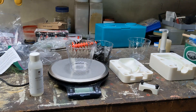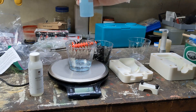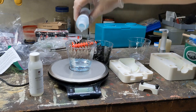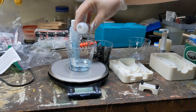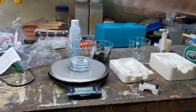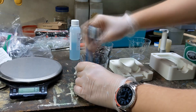Once I've got the carbon weighed out, I can move on to the resin. The one quirk I found with this kit — linked in the description — is that it was labeled as a two-to-one ratio epoxy resin, but it didn't say whether that ratio was by weight or by volume. Some epoxy resins I've used do specify that and often have different ratios depending on whether you're going by weight or volume. Luckily, it is labeled on the containers what the weight of each container is, so I could figure it out from the labeled weight. That's the only problem I've had with this kit — other than that, I've been happy with it.